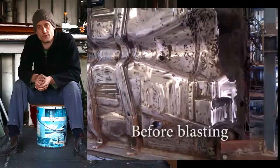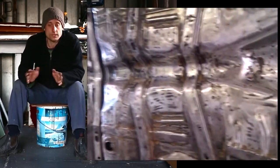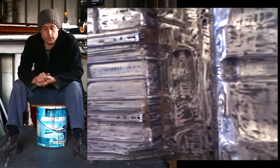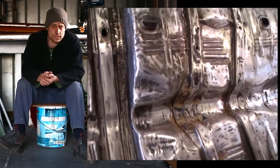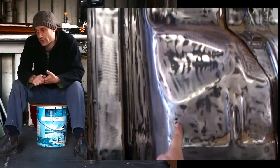I tried to get away with not sifting my media. Big mistake — blocked every two seconds. The smallest flake of paint will completely block your blaster, even if it's much smaller than the tip. I thought my work was pretty clean, nearly ground and wire-wheeled the thing completely clean, but even one crumb of seam sealer and you're blocked. It's no trouble sifting the media — you can get a nice big funnel from the paint store that sits on top of the blaster, then I made a strainer out of a milk crate and some steel fly screen, and just shoveled it in. Actually no trouble at all.